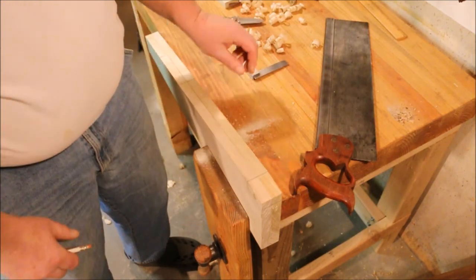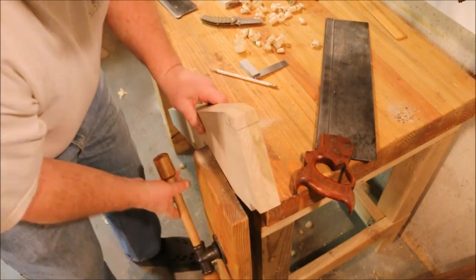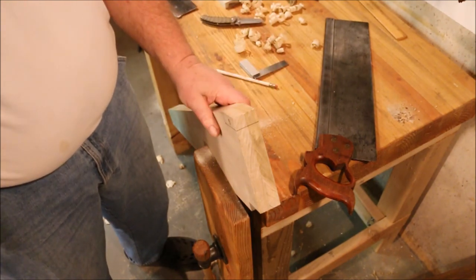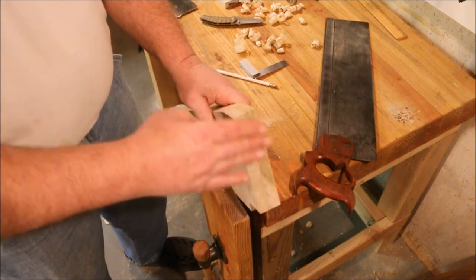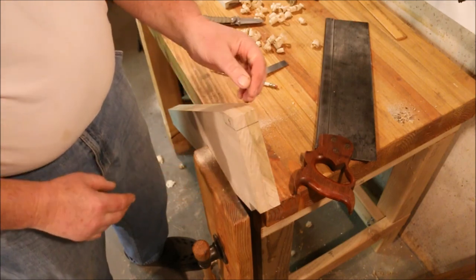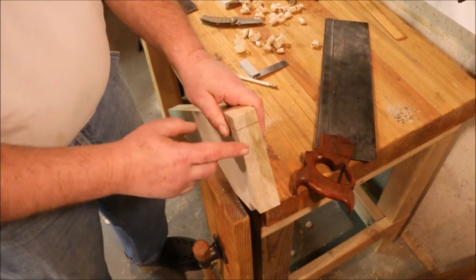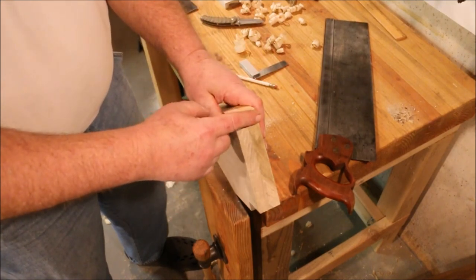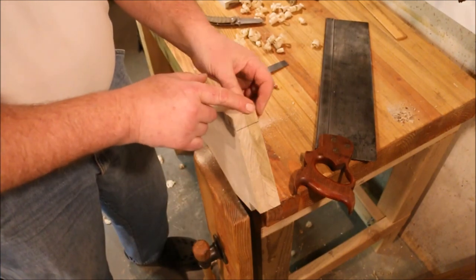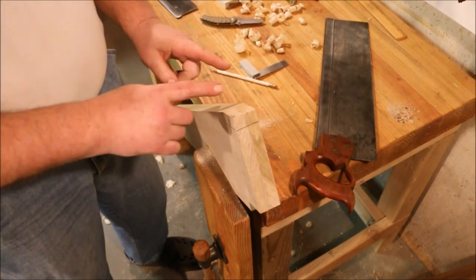Well, when I'm cutting a piece of wood, or in this case, planing, I'm also thinking about the wood not as an opponent, but what the reaction is going to be from where I leave it. As I was planing this, I wanted to have this area just as square and flat as I could get it. But I also knew that wood has a tendency to split out. And I tried to not come close to the ends because I knew I was going to cut off 3/4 of an inch from both ends. But if I did make a mistake and knock a chunk out, it was in the waste. Playing for the leave.